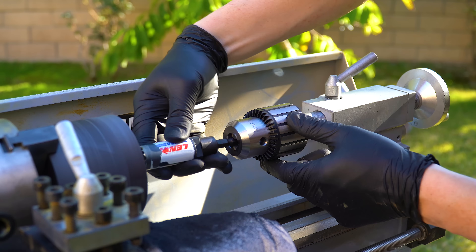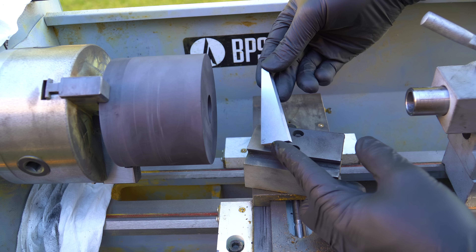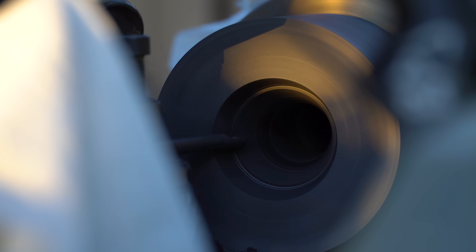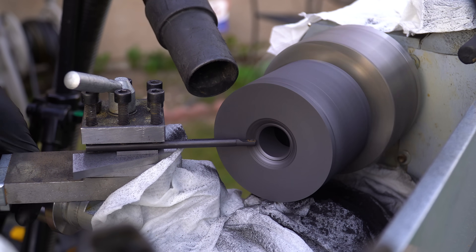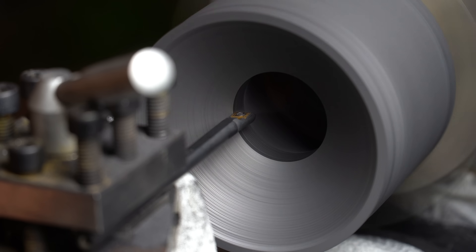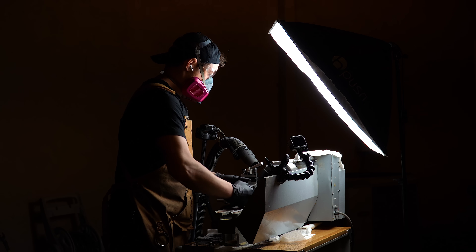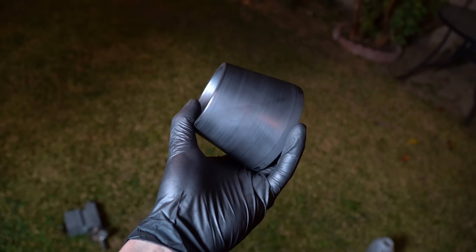After turning the outside, I used a hole saw to bore out the center and got to work on the tapers. With my little eBay lathe, this meant using angle blocks to accurately set the taper angles. I did a lot of this work using a super wimpy boring bar, because I didn't have anything larger at the time. You can also see lots of line patterns forming because the compound slide doesn't rotate well enough to move consistently. After turning down the final throat diameter, I turned the taper on the outside of the throat insert and began sanding the surfaces smooth. The final product came out looking very pretty.